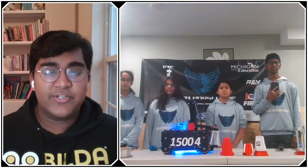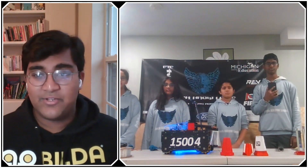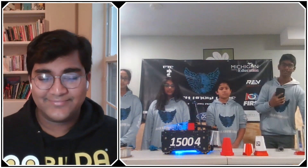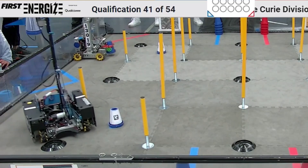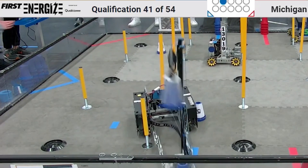Why don't we get started with your drivetrain? Something that's often overlooked in FTC is manufacturing and how you can use that coupled with your design to aid robot progression throughout the season. I know you guys do something a little special with your drivetrain — can you give us some insight into that? So what we have is waterjet cut drivetrain plates, which when put together can create four individual drivetrain pods. One advantage is we can use those four pods for every challenge by moving the distance between them — positioning them for a longer or wider robot.